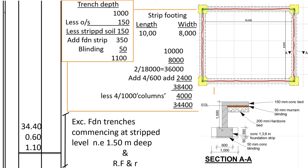If we check on the red part, it begins at the center of the column up to the end of the column base. To get this length from the center of the column to the end of the column base, we shall take the total length of the column base. The total length of the column base was 1,000. 1,000 divided by 2 was 500. If we divide the total length of the column base, which is 1,000, by 2, it will come to the center of the column. Now that one has given us the length from the center of the column to the end of the column base, which is 500. If we have 500 for the length and 500 for the width, so we have 1,000